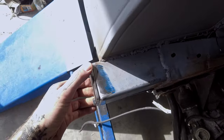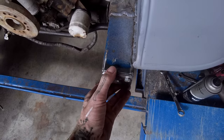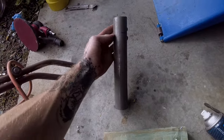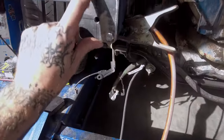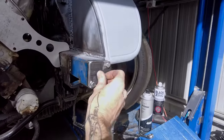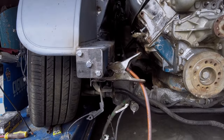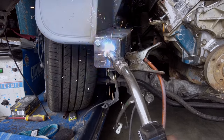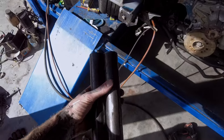Nothing's super mangled looking but that's a lot closer to being straight. Even though I didn't use a center punch they still line up pretty good. Once it's all sort of done I'll square them up side to side — doesn't matter if they're not perfectly matching. What I'll do now is use this bit of tube that's marked the right length, find the other tube, and use the drop saw so I can get a nice square edge. I'll cut two of these out. Those holes — I'll drill them out and basically get these bolts in there nice and snug to locate it. I've got one bolt up top, two locators down here — once it's all tied together it won't really matter. Because the pipe's going to be a fair bit bigger diameter, I'll try to get a big tack on there — it's galvanized, which is awesome.